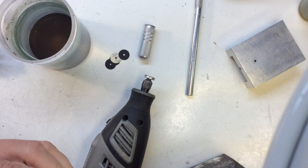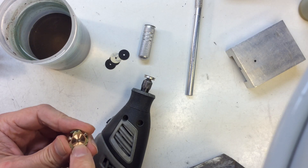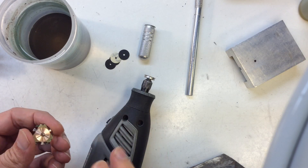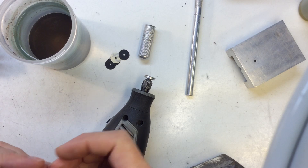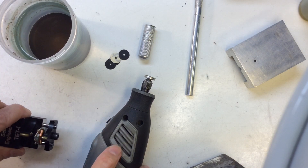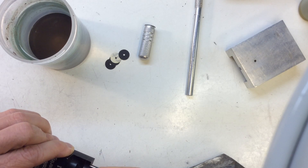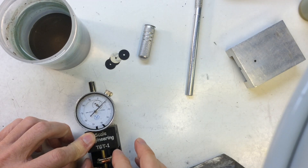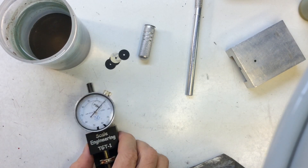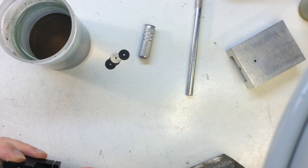It might take up to a minute to get them down. You can't take more than about a thou off or so, because this copper coating is only about two thou thick. So you've got to get it pretty close to flat to start. When you're all done with that step, you come back and double-check your flatness. I'll put this in the Scale Engineering TGT1 comm checker and run it around. Looks like about half a thou — that's good. Usually I'll also check the ohms just to make sure I haven't broken anything.